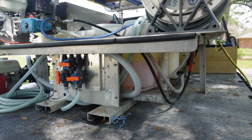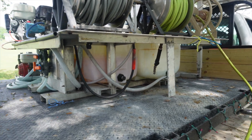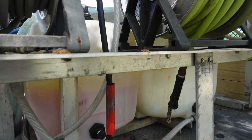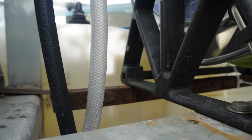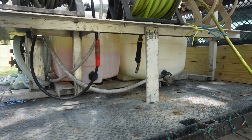Just got everything put back together. Pulling some water, filling up the water tank. We're going to see if it's back feeding. Right now sitting at just above 45 gallons. Hopefully that fixed our issue — just a little bit of trash in the check valve.